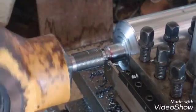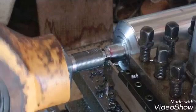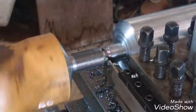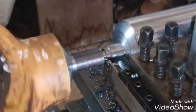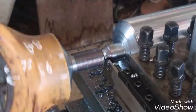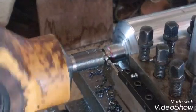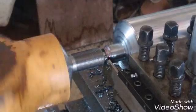It's working quite well — I could probably go a lot faster. I've got a lot of stick out on the parting tool because I've got to get away from the shaft. Parting I usually like to use with the cooler — it seems to work really well for threading and parting. On this lathe I haven't got the cooler set up; it's really not worth it for me as I don't use it that often. When you come to use it again all the coolant will have evaporated away.